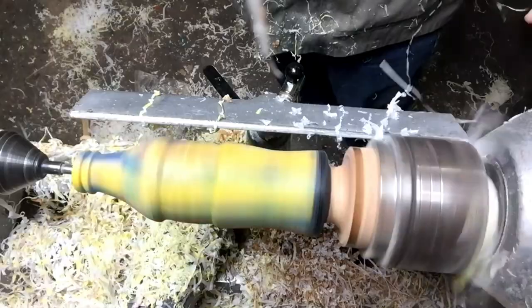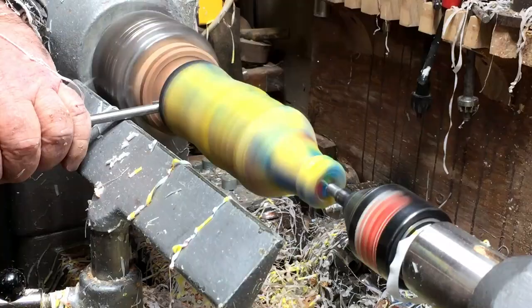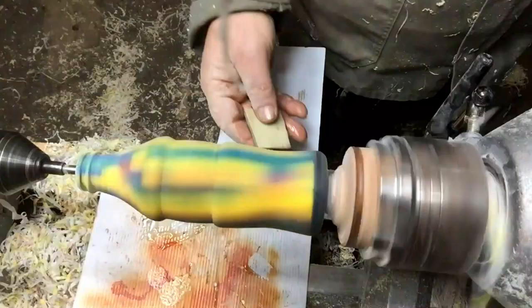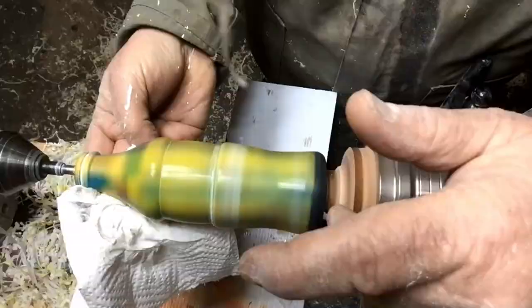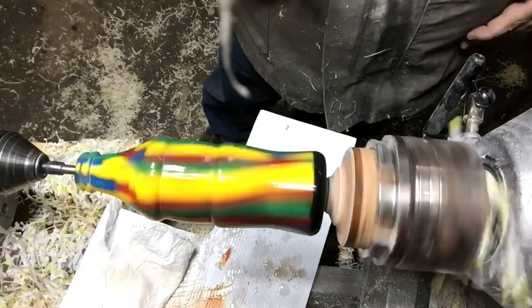I'm creating a wide area in the back so I can start polishing as deep as possible. I'm using the diamond-shaped detailing tool from the mini set to give me enough space to reach with sandpaper. I'm using 150 all the way to 600, after that water sandpaper all the way to micro-fine. Then I'll use Novus 3 and 2 — the Novus heavy scratch remover and then the fine scratch remover. When I finish you'll see what a huge difference it makes — look at that, now it's see-through like glass.